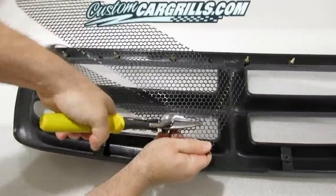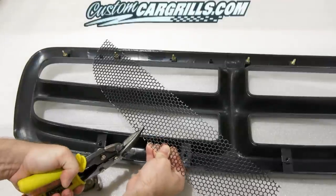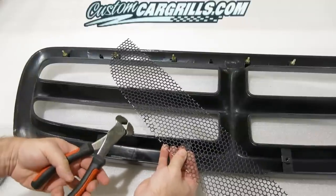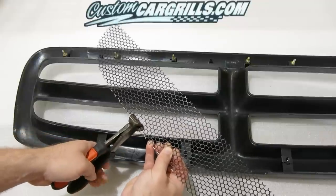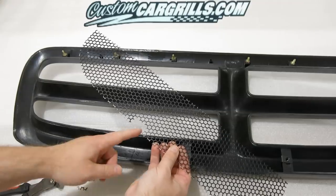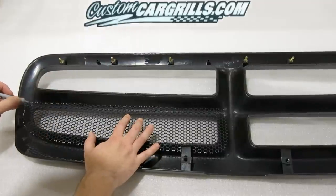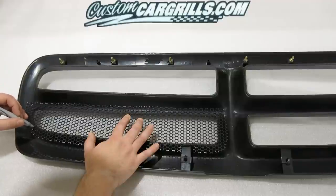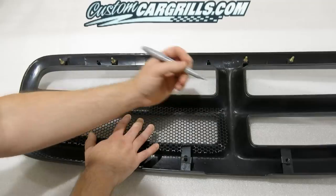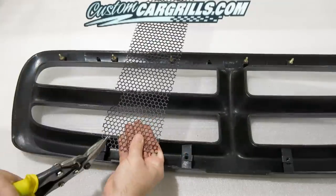The parts that I marked off for the tabs, I'm going to get in there with what they call either a wire nipper or sometimes an end cutter. The first thing to do here is just to cut some lines going up towards where the tab would be and then use the end cutter and notch out where the tab actually is. When using this tool, you'll need to be very precise. Any slight miscalculation on the tab and you could end up with a gap showing through the front. Some of the corners of the grill mesh piece that we cut out are going to need to be notched. The reason that I'm doing this is to prevent any sort of bunching up when we fold the excess part of the mesh on the back side of this opening. Just like with the notches that we made for the tabs, try not to over cut here. You don't want any gaps showing through the front.